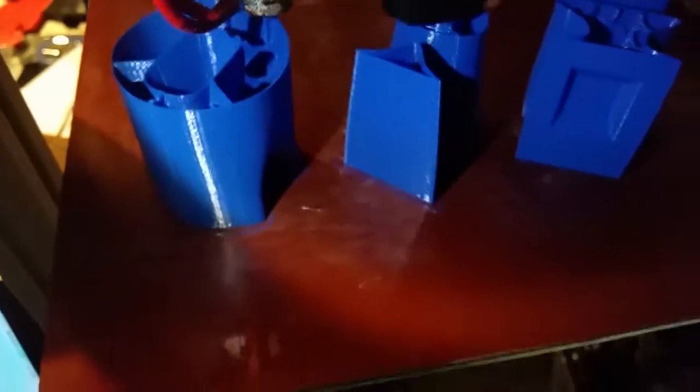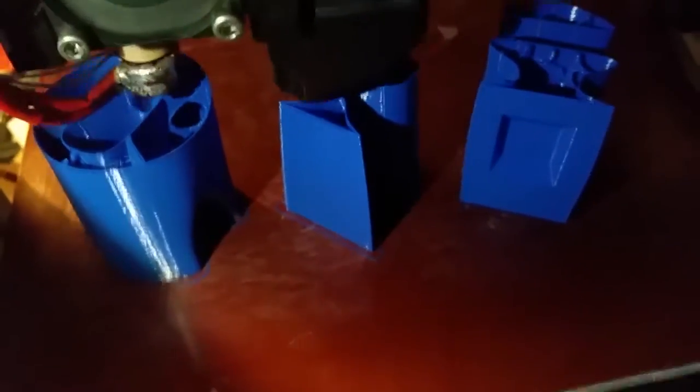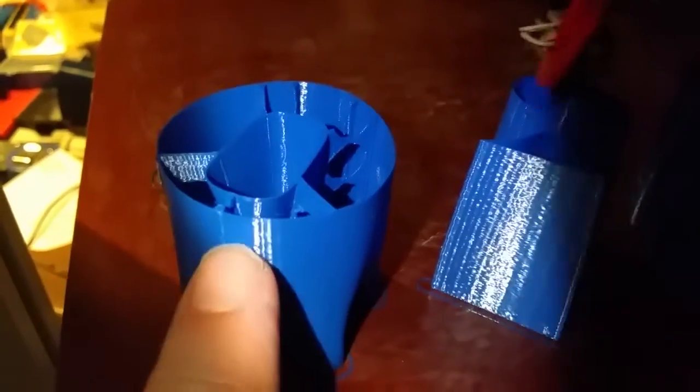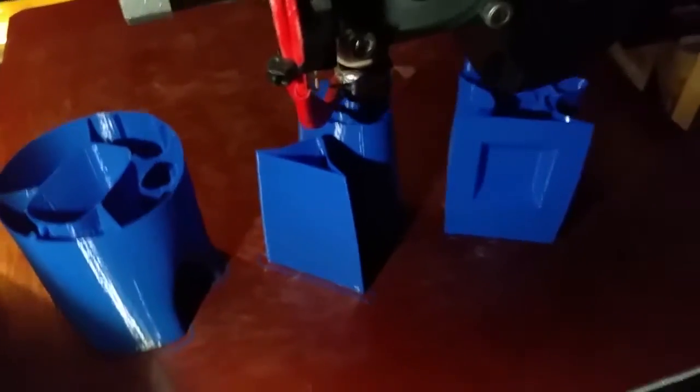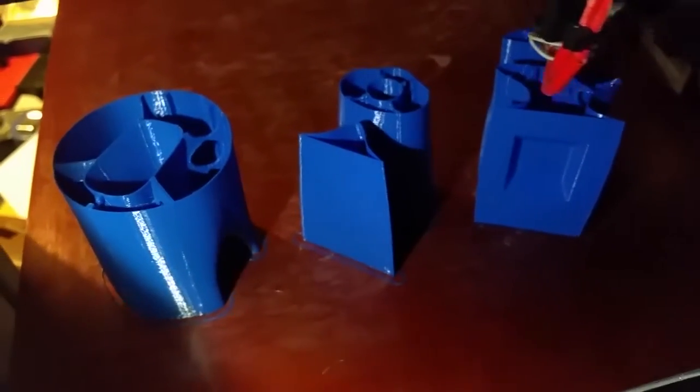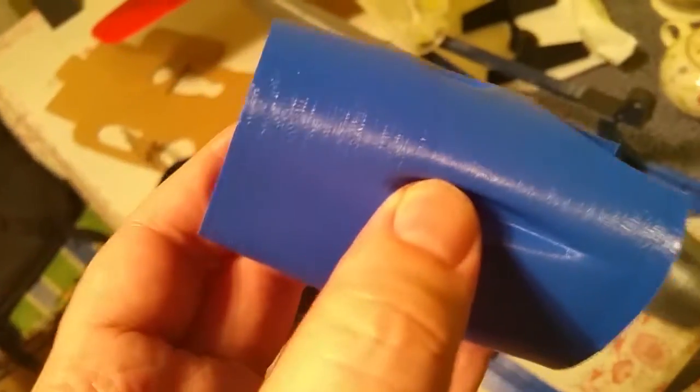I can show you the rest of the fuselage. Now I print in one turn on one print, and I combine more parts and I modify my temperature minus 10 degrees Celsius, and I think it will be really nice and okay, and it will be strong enough. You just must find parameters exactly for your filament and your printer, and actually for the job which you print now. In a different job it could be a little bit different.